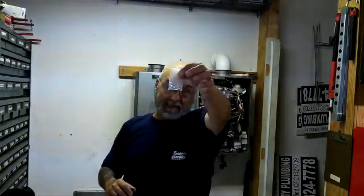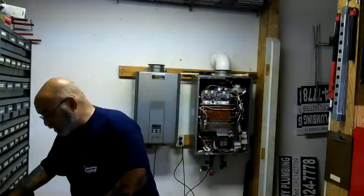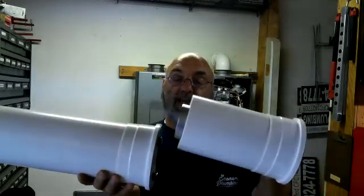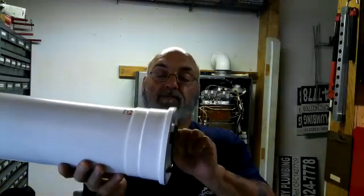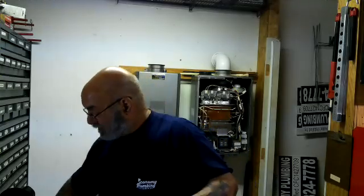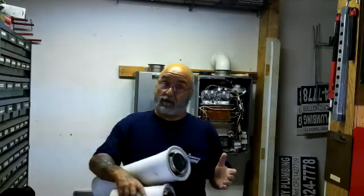For both condensing and non-condensing, in every box you're going to get a bag with three-quarter by half-inch sheet metal screws. When you engage this into this and push it in, you're going to put the screws in equidistant parts, almost up against this lip. That screw is going to grab and hold these two pieces together. You don't want to put a two-inch screw through here and go through into the silver, because that's going to do the same thing as cutting it flush — it's going to suck that small amount of carbon monoxide into the fresh air, causing undue stress on the burner.